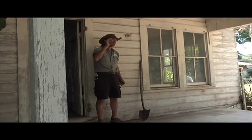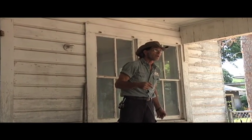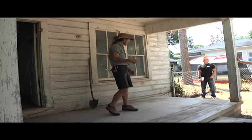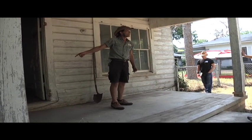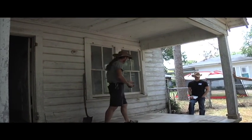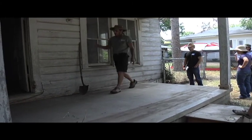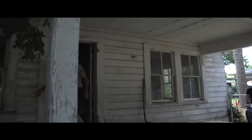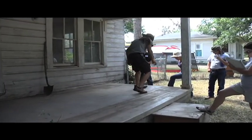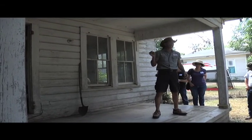The best place for a termite nest is in a good concrete bunker. More termites will start under a concrete slab, have their nest there, and enter the house than almost anywhere else. Why? It's cool, good moisture, and well protected — so they'll penetrate over here, go into the beam, and march through the house. What you look for is: are there any holes in the concrete that have been plugged? That tells you if it's ever been treated for termites.